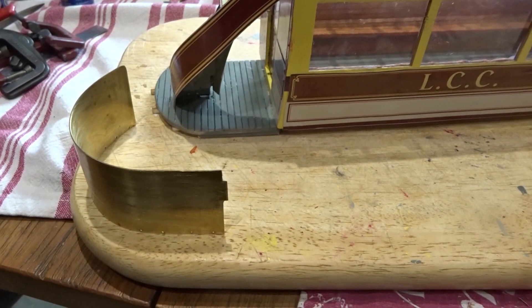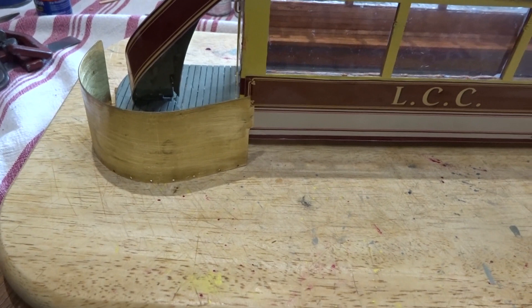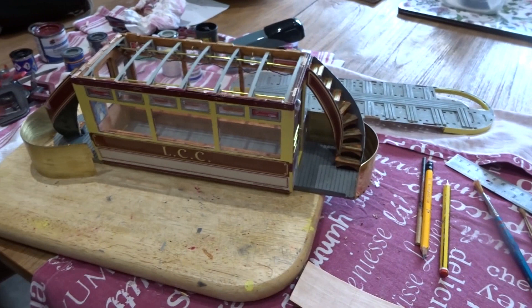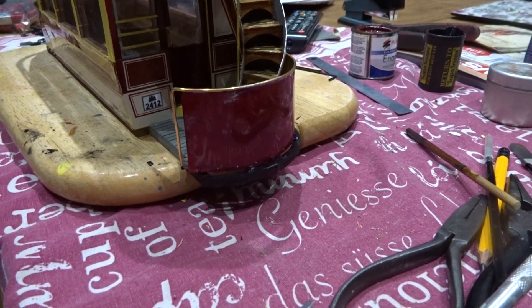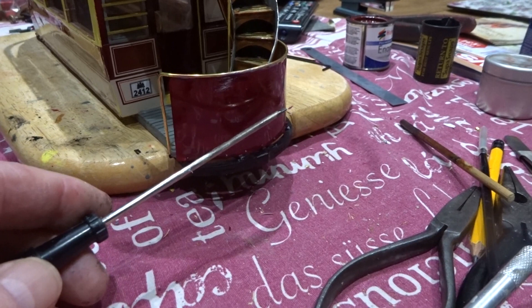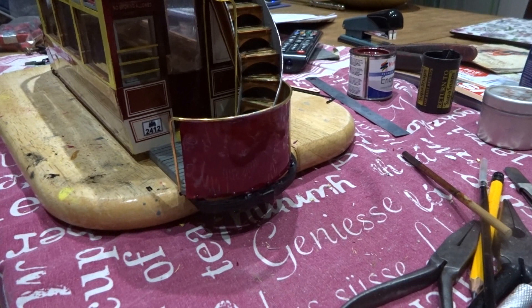One end's done and I'm about to install the other — just a bit of thin 24-gauge brass, which of course is quite amenable to bending and staying where it's put. The brass round beading that came with the kit has been soft-soldered to the brass balcony ends that I've fitted to this carriage, rather than gluing as the instructions originally suggest.